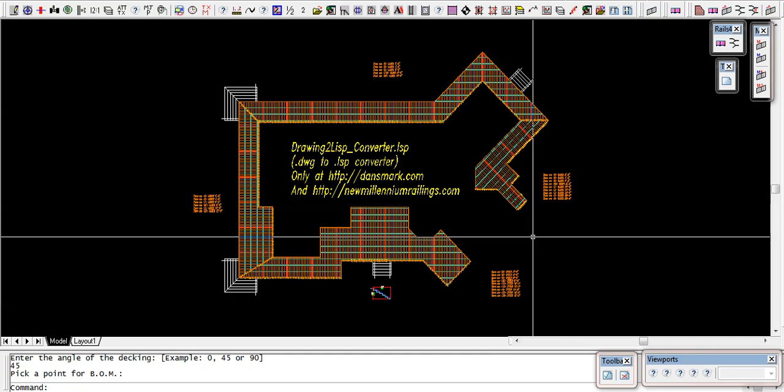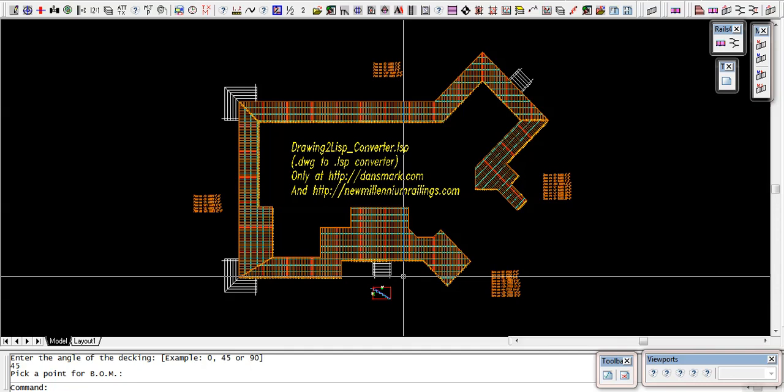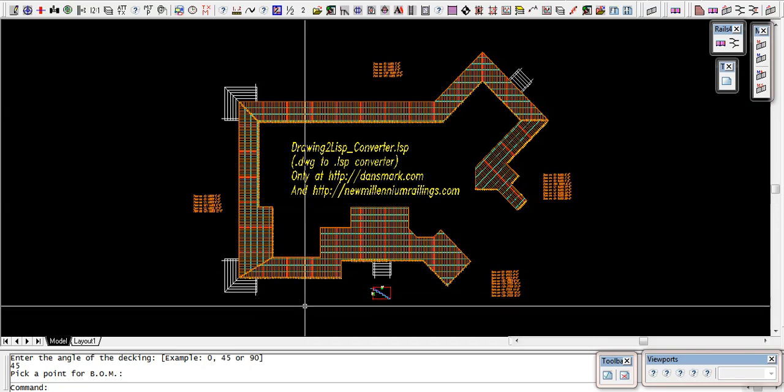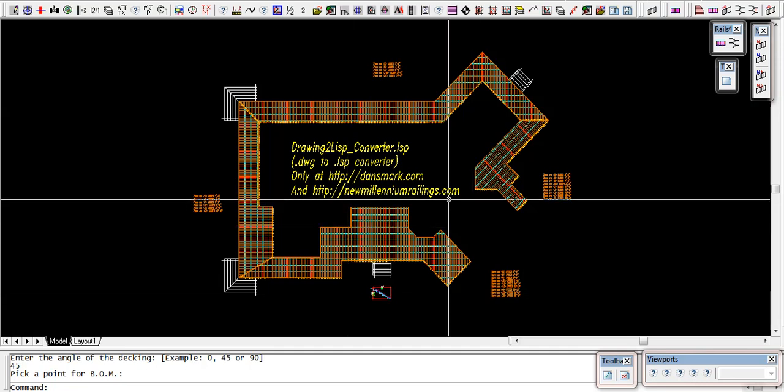Right now, all the red that you see on here are girders, and they're spaced 8 foot apart. All the light blue or cyan colored are the joist, and they're spaced 2 foot apart. And the decking, of course, is 6 inches with a 5.5 with a 1/2-inch clearance between them. But if I get enough interest, I would modify the program so that you could control your decking boards. If you want to do a thinner width on a decking board, 4, 5, 6, 8, 10, it doesn't really matter. It could just be a variable that you put in, or once you put in your parameters for your decking, it now becomes default, so that you don't have to change it again.